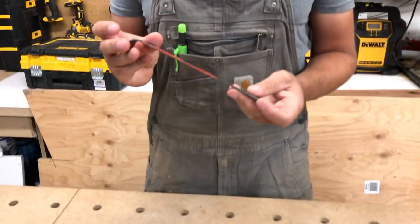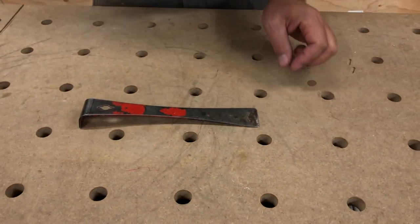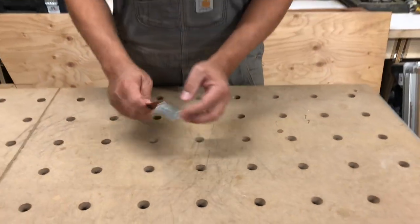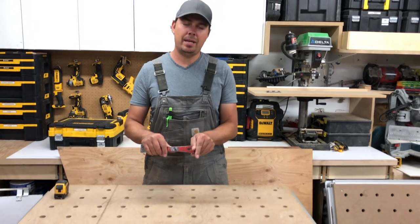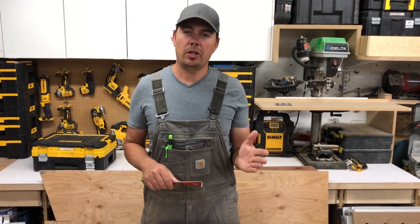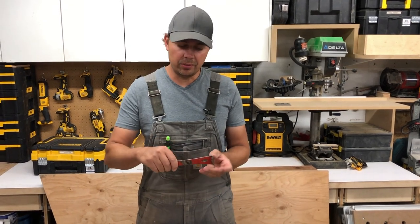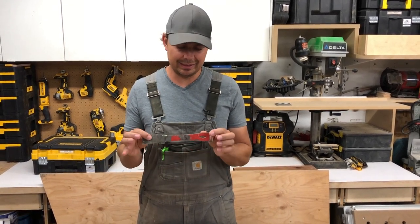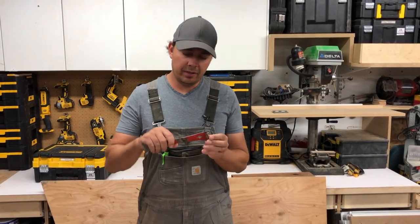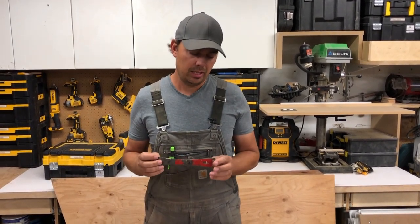This is something I always use when I'm installing doors. When I'm installing my door jamb, I will use this to rock in between the door jamb and the framing just to level out my jamb. I'm always starting with my hinge side, nailing that off, and then I use this to just tweak it a little bit. Because it's small, it's thin, it's not too heavy, it's very easy to control what you're prying and tweaking when you're adjusting a door jamb.